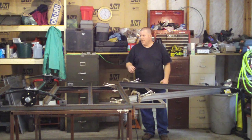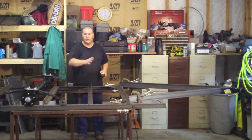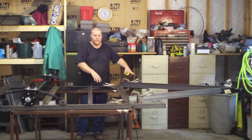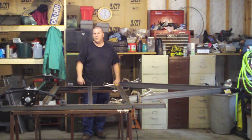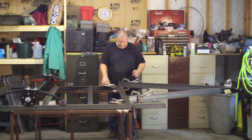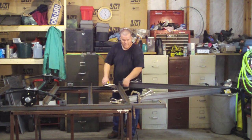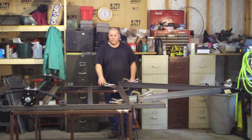I'm going to skip around when welding — weld a little bit here, then start welding over there, jump around — so you're not pouring all the heat into one spot. By the time I get back to an area, it'll have cooled down a bit. That way things aren't twisting and warping. It will move a little bit but that's no big deal. Since I'm using sheet metal on here, I'll stitch it to the sheet metal so it'll be welded to both the floor and the framework.